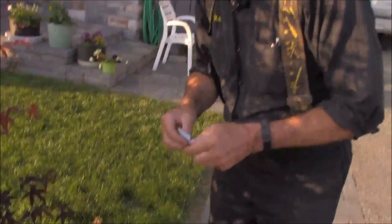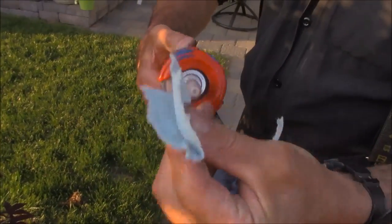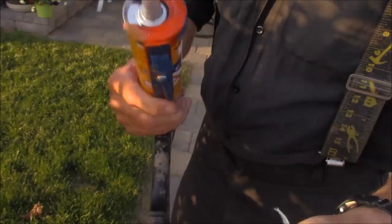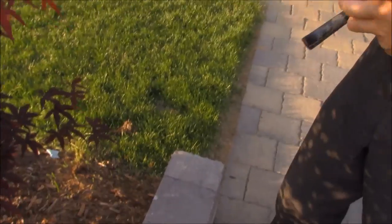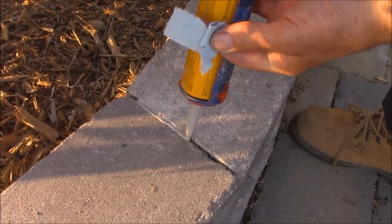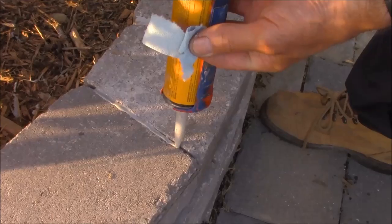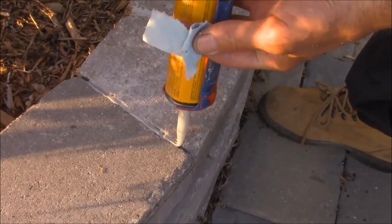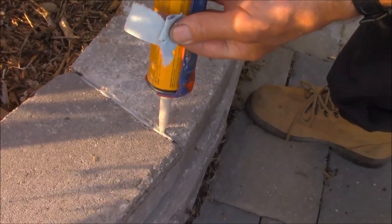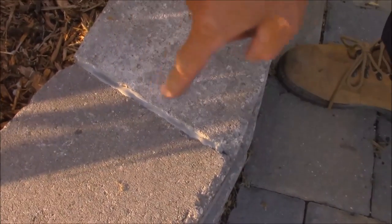Here I've got a little caulking coming out of this gun. I want to take a paper towel and clean the tip — when I go to my joint, it's clean. This little piece of paper towel I can throw away. When I'm all done and they dry out, I'll go around the job site and clean them up. This goes in the joint — it's going to start to level and go down and disappear, which is the good. The bad is it goes down and disappears. It's already starting to sag.